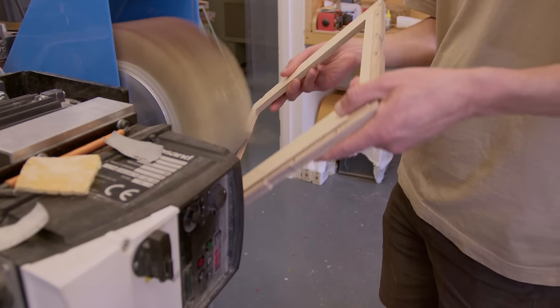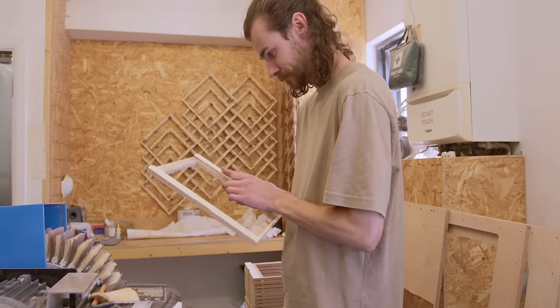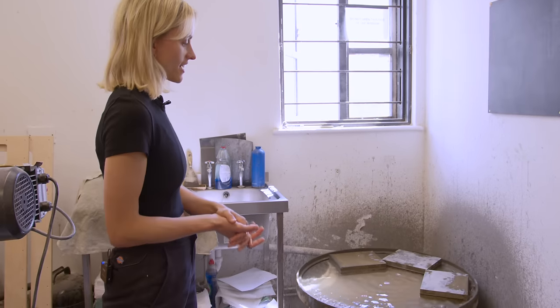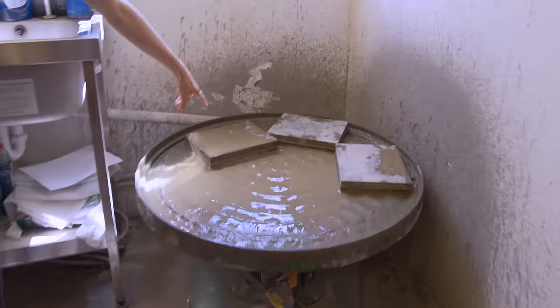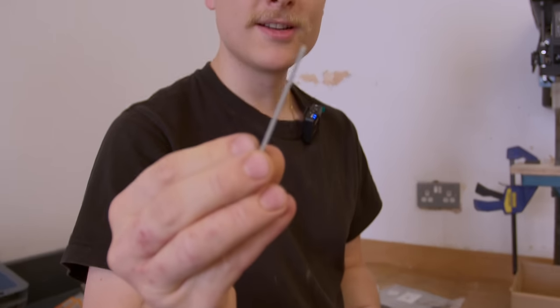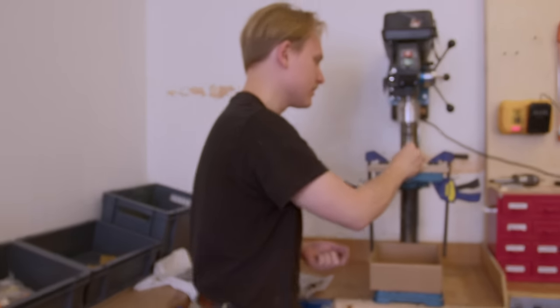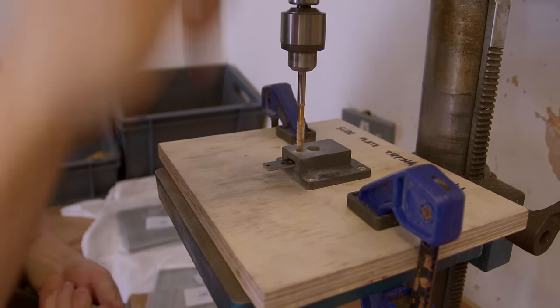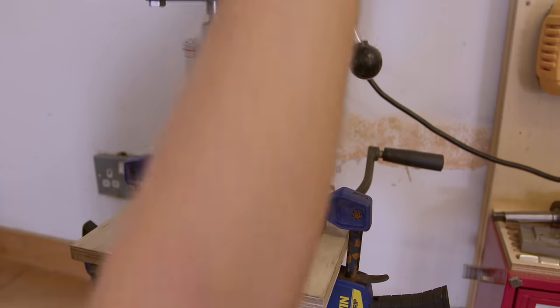Yeah, this is where everything starts out. Most of our cameras have a lot of wooden components, and we make them all here. We've got Matt over here who's currently doing some sanding, and then everything is varnished and hung up to dry, and once it's dry the parts can go on and be assembled. So this funny-looking machine is a glass grinder — under these slabs there are sheets of glass, so it's grinding the ground glass, and then once it's done we laser on the grid for focusing. These little components here are part of the tilt-shift mechanism on the front standards. We process these by hand — they fit inside this jig here, and we have thousands of them to do. This process cuts the thread in, and later these will have a specially designed bolt that screws and glues in place, forming part of the tilt-shift mechanism.